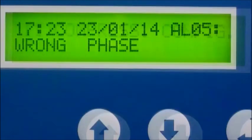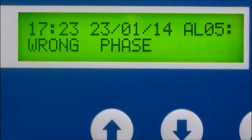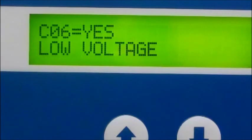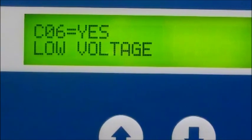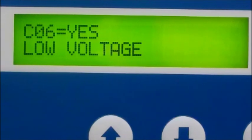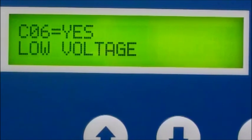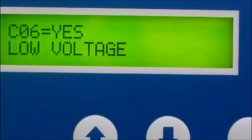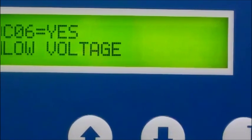We can start with compressor protection features. The PLC senses pump reverse rotation and has loss of phase detection. Also, high-low voltage protection, high and low temperature sensing, low oil detection and shutdown, and control of maximum motor starts per hour, coupled with motor over-amp shutdown.